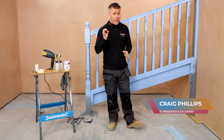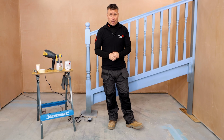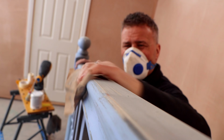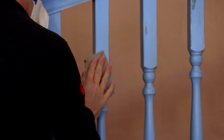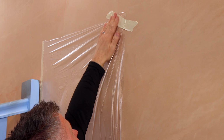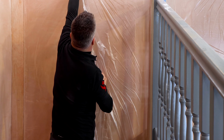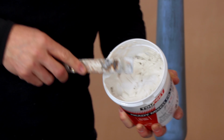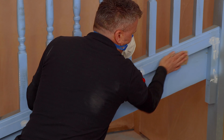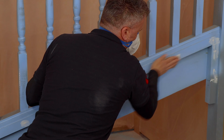and Mrs. DIY. In this video, I'm going to show you how to paint your spindles, handrail and newel post. When painting any item, preparation is really important. First, sand down all the surfaces the best you can. If you're using a paint sprayer, you will need to mask up around the areas that you don't want any paint going on. If you happen to have holes, you will need to fill these with some filler, let that dry and then sand it down and it's ready to paint over.